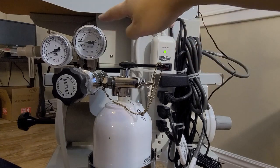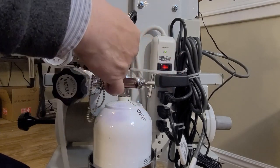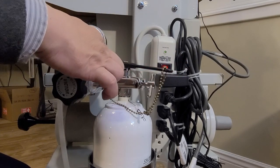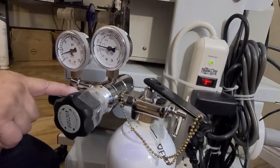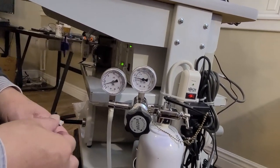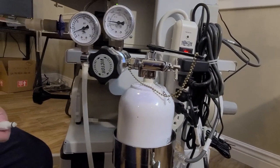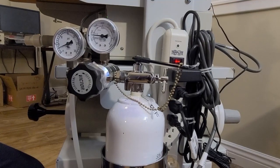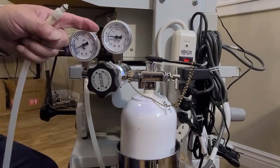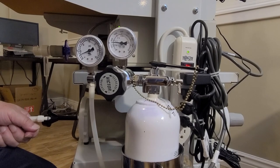What if you put it in the off position, and then this starts dropping pretty fast? That means leak. Uh-huh. Leak can happen at this valve, at here, the washer, at the regulator, at this connector, or at this end of the CalGas tube connector. All can happen. So once you put it in the off position, these dials should look about the same, stay at the same level. They should stay there. Of course, a day later, this guy should drop down to zero because we didn't try to make the whole thing airtight inside the analyzer.